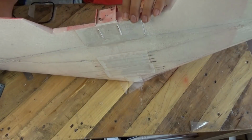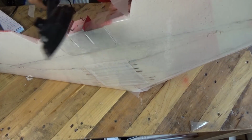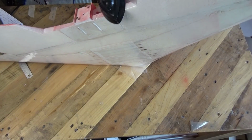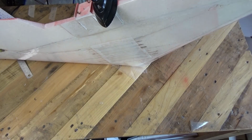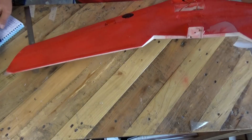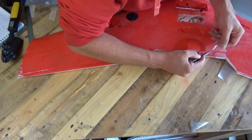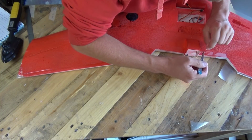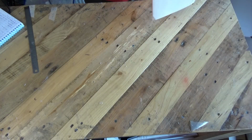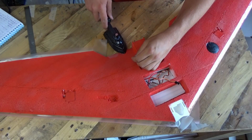Right. Let's do that. Got a patch there. Whoa. Tell how slippy it is. It was sliding on the desk then, whereas before it didn't do that when we did the first side. But the piece where we've already laminated, it was wanting to slide on the desk, which is always a good sign. And again, I'm just trying to get a straight edge on the back. And don't worry about your seams too much. Once you put the top layer on top, nobody notices, and all the crap joints will then be up underneath.